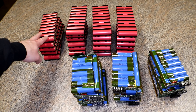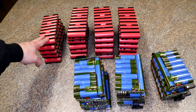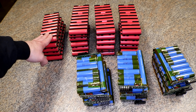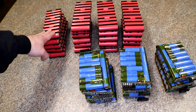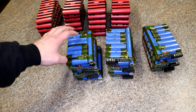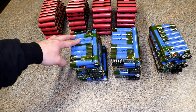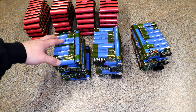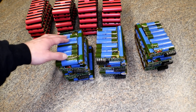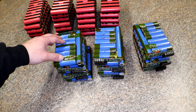These are also medical packs but they only produce around 1600 to 1900 milliamps. I do have quite a few of these and could probably get another 10 kilowatt hours out of them alone, maybe more like eight. These ones are a pain to get apart because it's almost like each one is glued together. Somebody suggested using acetone to take them apart, so I might try that, because when I tear them apart all of the heat shrink usually tears off.